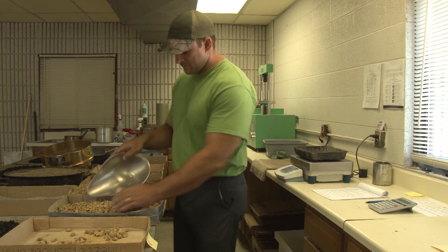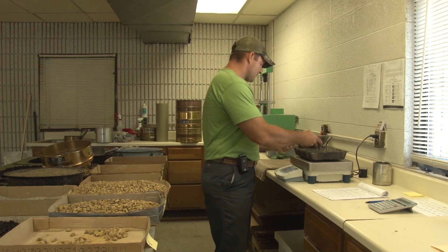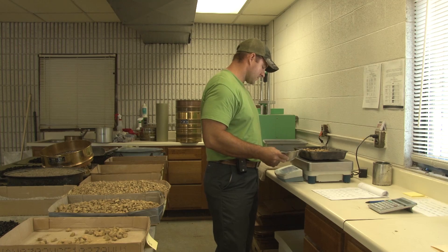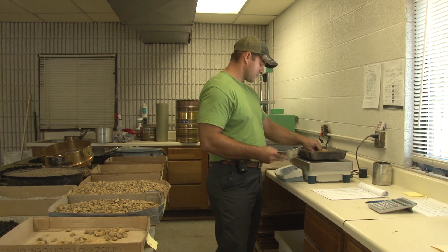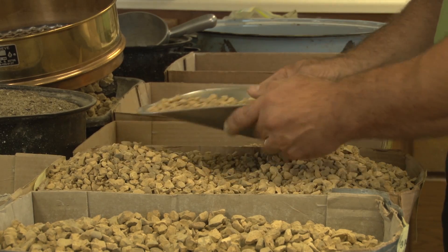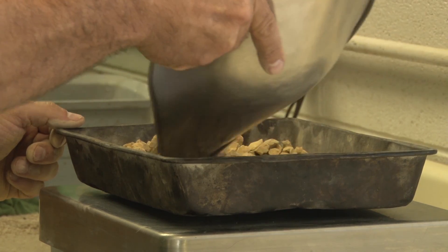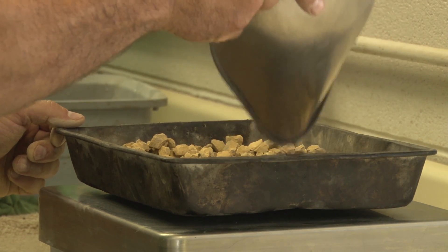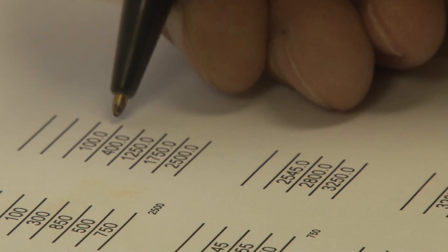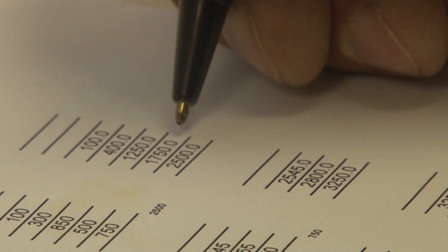The thin overlay mix being placed on this project differs from a lot of preservation treatments — this mix is actually an engineered mix, just like any other surface mix that a state DOT would use. We actually go into the lab, select the aggregates based on gradations and cleanliness, put those aggregates together in a certain blend, run through a mix design where we select optimum AC content, and engineer the mix. It's not just a maintenance mix that we pull out and throw down. It is an engineered mix, and because of its size, we can place it very thin.